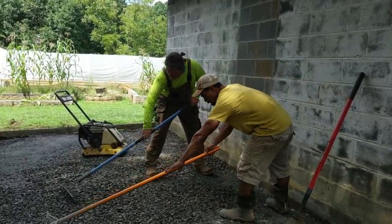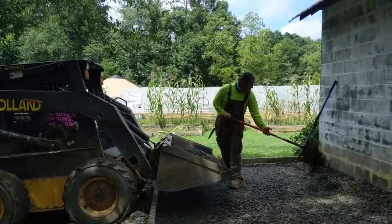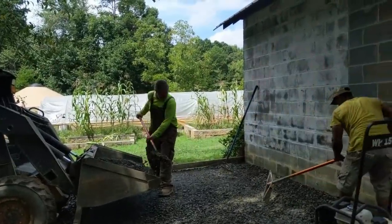Yeah, a designated area. So we had planned to do an overhang build off of this building right here, a warehouse. And to start that project, we recently got it started by first leveling out the ground here to pour a concrete pad. The reason for doing a concrete pad is because the roof will keep the rain off the tools from above, but I also want to have the ground dry underneath where our tools are being stored. And I don't want to be walking in mud trying to get our tools. So that's this project that we have planned for right here.